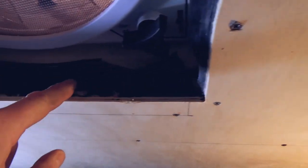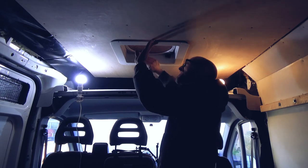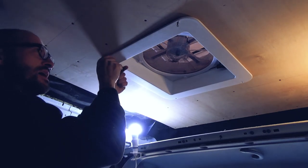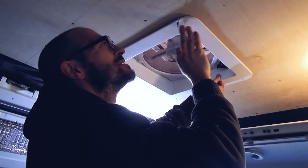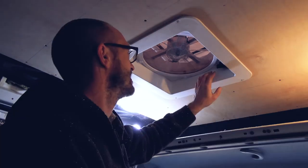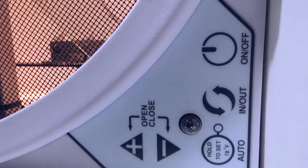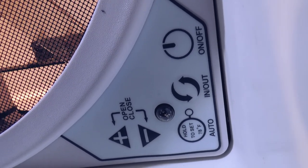Awesome — it's nice and straight and it's followed the line. It has torn the vapor barrier a little, and the flange is just barely deep enough through my very thick insulation. It's a little cool at one degree — I think I'm going to have to forego the weather strip behind there because it's just going to make it look too thick and may bow it out. There's dust inside the infrared sensor — a little bit of sawdust — so it's not dust-proof: be careful.